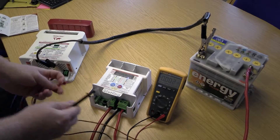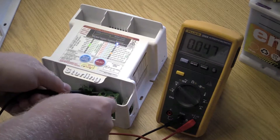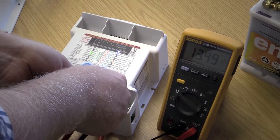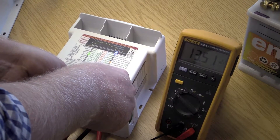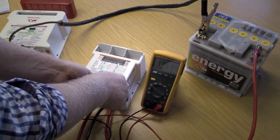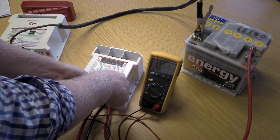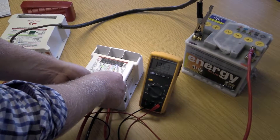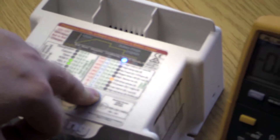The second thing to try: let's say you've got a healthy input voltage of about 14 volts but your output is not in boost — you're stuck at 13.5 volts with very little current flowing to your batteries. It can't be constant current mode because there's no flow of current. The chances are that the buttons have been fiddled with and the unit has been put down into float mode. You can see the float LED is on. To get it out of float mode, simply hold down these two buttons for a couple of seconds and let go.